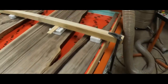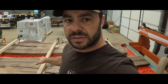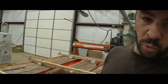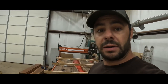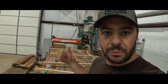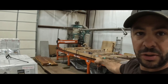We're getting ready to do the pour. Because it is so cold out — about 40 degrees right now and down to 20 at night — we're going to try and push the limits and do it all in one pour. Normally in summertime I'd probably do two pours, but epoxy generates its own heat and just takes longer to cure in the cold. It can't be too hot or it'll crack, so the cold actually works in our favor today.